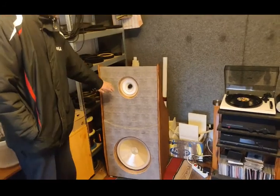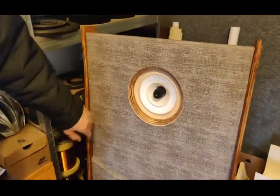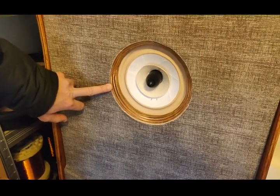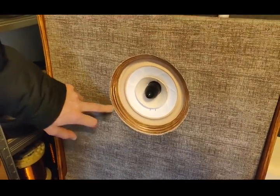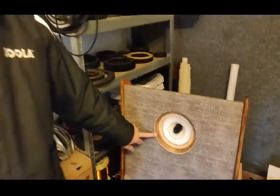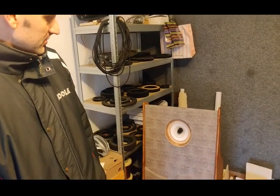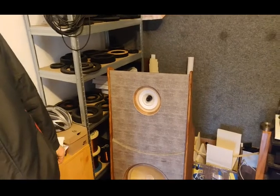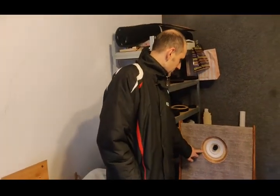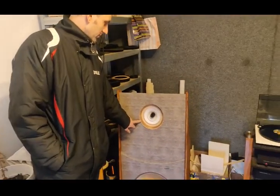I'm doing my loudspeakers for a few years. This is actually a reconed loudspeaker, not the original. The originals have much harder and heavier cones than mine. This is the first version of my loudspeaker with a clear outer wire. The second version is even much lighter — the woofer is less than one gram with the coil together.